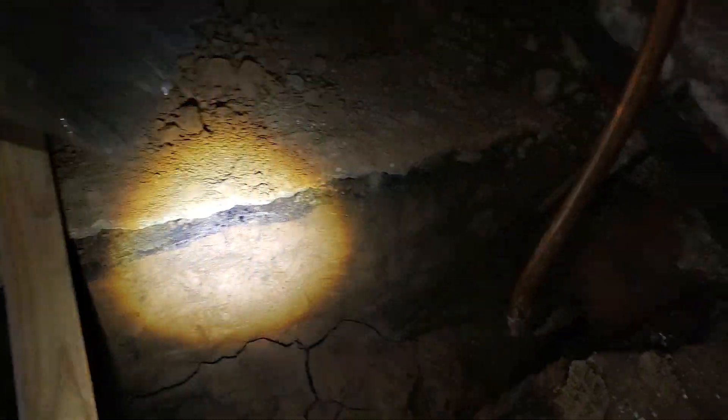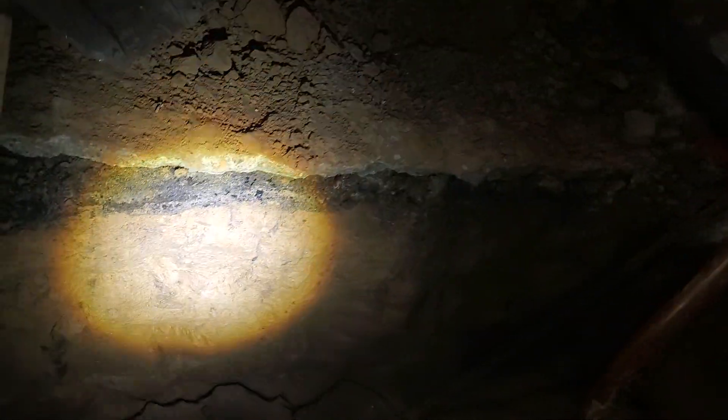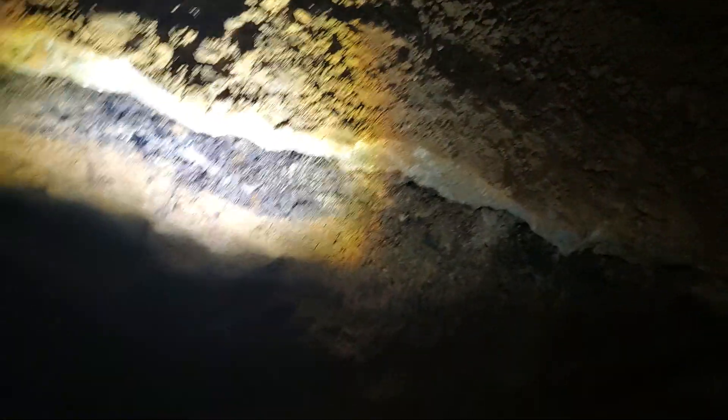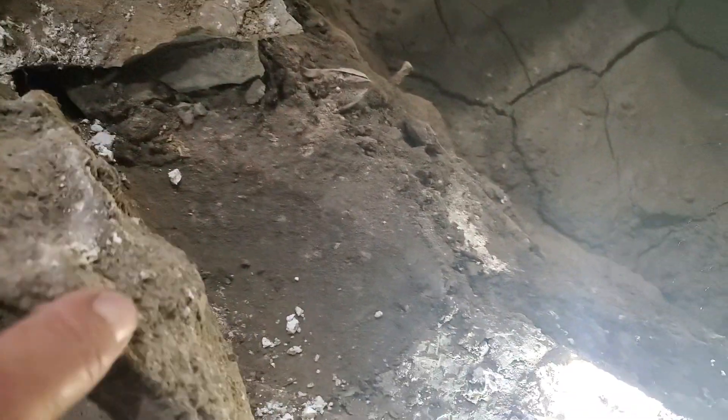This is something I wanted to share with you — on our concrete floors, see that, a lot of these are only like — I'm going to get up closer so you can see it — they're just a few inches thick. Supposed to be normally 4 to 6 inches. But look at that, that's right off the floor here. See how thick that is. They just poured it without any gravel or any substrate underneath of it.